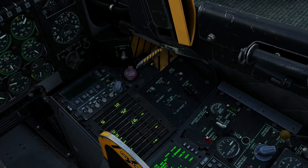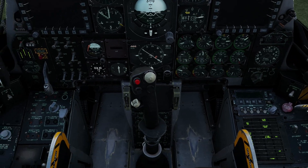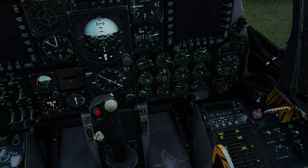Something I should have mentioned earlier: we start the engines with the AC generators for both engines in the on position, so as soon as the engine comes on, it is already supplying power to the aircraft. Let's start the right engine now — same process, but this time it's Right Control and Home. That begins an automated engine start.